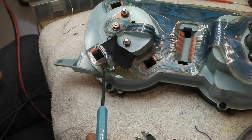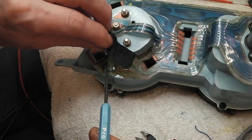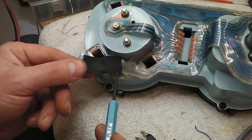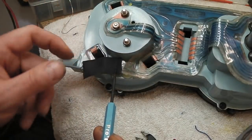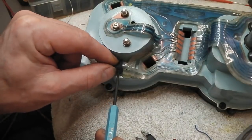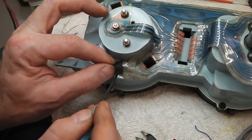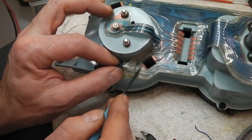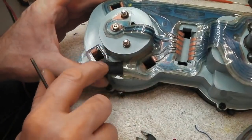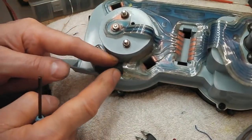We've joined those two little repair jumpers in, fitted this new bulb pad here, and now we'll put a little bit of repair tape over the top, and we can cover that repair like this. And that's, I suppose, really the best we could do with that damage, to make that little patch like that. That's in. One more little piece of tape just to hold this down. See how it's trying to peel away. I want to stop that if it gets any worse. Not that once it's behind the dash you'd have any real problem, but still.